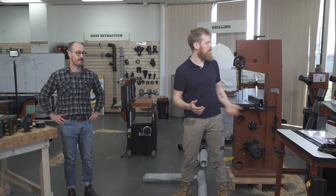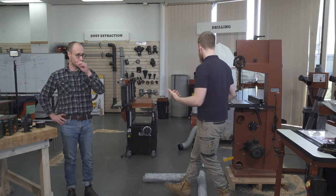Once you move into cyclone separation, you really start having to take into account static pressure. There's a lot of science behind it that we've been testing for the last couple of months and into the next couple of weeks, to make that a lot more accessible and easy to understand. If you're looking to put a cyclone dust extractor unit with the FM300, you're probably going to lose about a third to maybe half, but it'll still keep the static pressure relatively high. I've been quite surprised at how much drawing power the combination machines maintain. It's quite impressive.